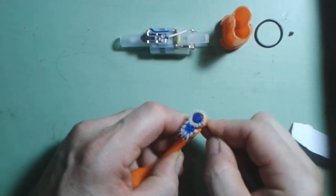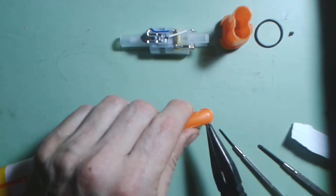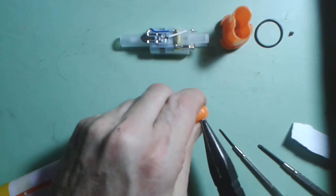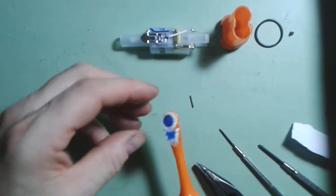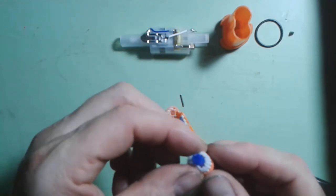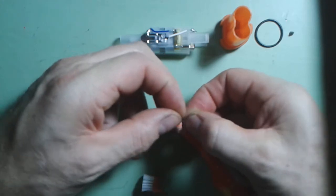Push on this end slightly and it will push the pin out the other side. If you grab hold of that with a pair of pliers and pull gently, the pin will start to come out of the head. Taking the pin out completely then allows you to take the hood away and pull the whole unit apart. You can see that the centre unit — the blue brushes — is the bit that the pin goes through, holding it centrally in the unit.